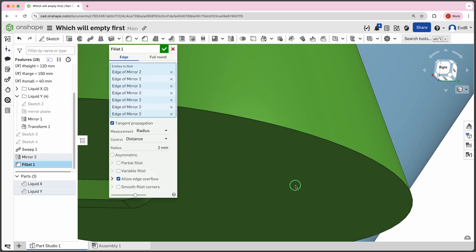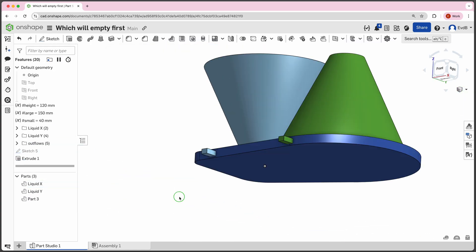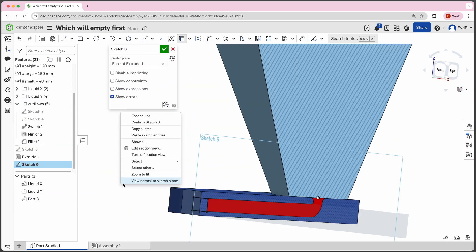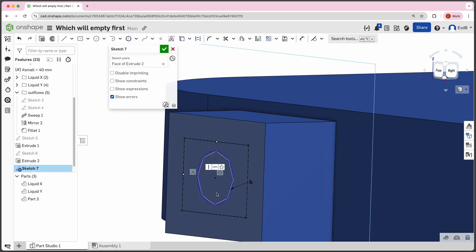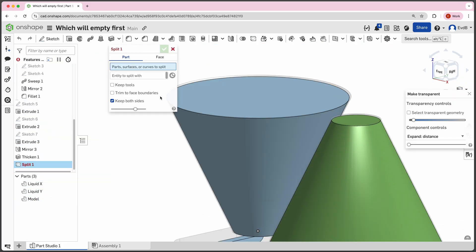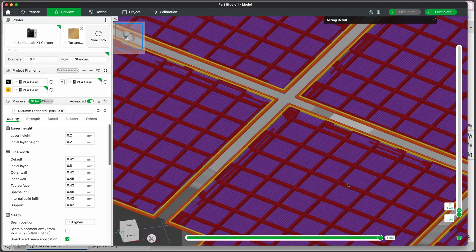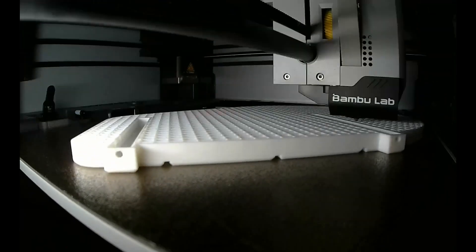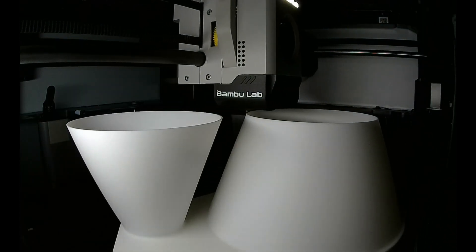In the CAD work, what I've done is created the green and blue cones here, which represent water inside the tank. And once I've done that, I'm then going to build a tank around it, which is this blue thing you can see now. A bit of fiddling around whilst I'm working out what I want to do. Export into Bambu Studio, and here there's just a few things to check so that it prints cleanly. Send it to the printer, and here we have four and a half hours of printing in just a few seconds.